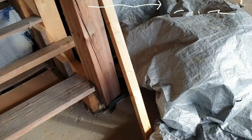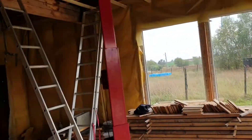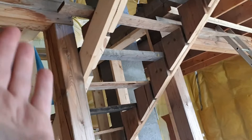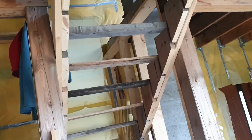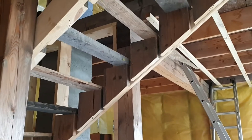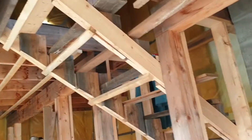What's left to show you is that battens still need to be done here, under the staircase. For gypsum board the distance of one meter is too much, so we'll put battens here at 50 cm spacing. Here too we'll need to offset by those few centimeters. That's it for the rest — as it comes out. You'll see in a moment. And that's how it looks.